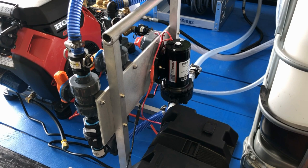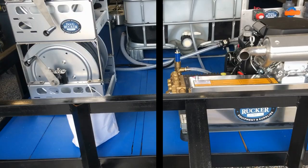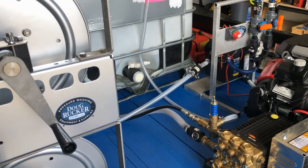Especially roofs — it's very important that you don't oversaturate, that you don't flood coat a roof to where it's just completely running off. That's a problem I see a lot of times with guys that get these larger pumps, whether it be the twin pumps like we have over here.